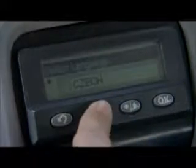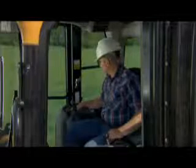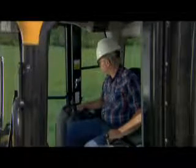The new full-text Crystal LCD monitor is easier to read. Diagnostic codes and machine information is displayed with large numbers and text, and bar graphics that quickly show you fuel used. Plus, information can be shown in multiple languages. Simply use the 4 buttons at the bottom to modify parameters, such as engine idle speed and idle shutdown time.